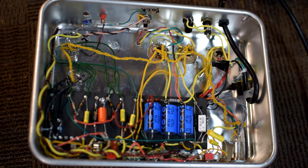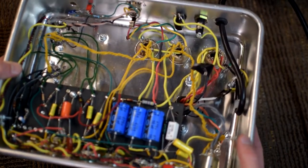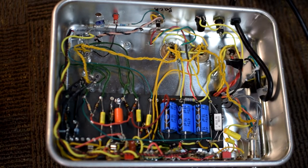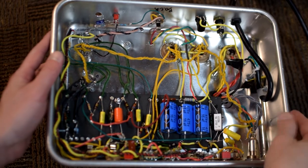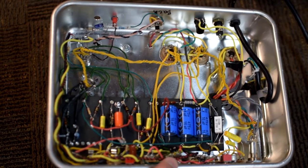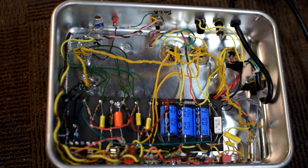Some guys will use some blocks of wood or some books to build up the chassis so it sits a little more stably. That would be a great option. Other guys I know have used some woodworking skills to build a cradle that'll actually grab and clamp on the amp on both sides and give you an absolutely secure amp chassis. The main reason is that if the chassis is prone to wobbling while you're pushing and poking in there, you may have a slip occur, and that could cause an inadvertent contact, and that's really where the bad news is going to occur. So make sure that your amp is secure.